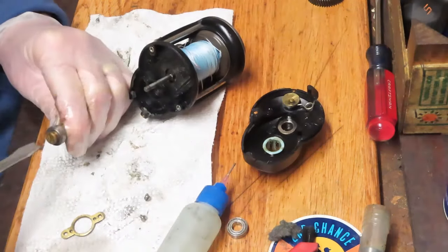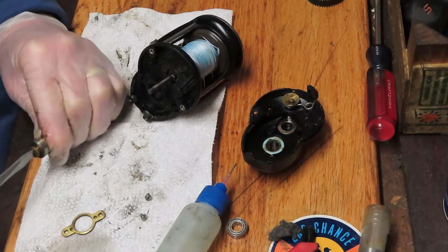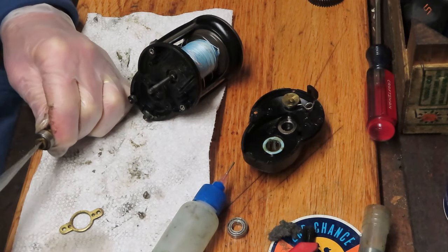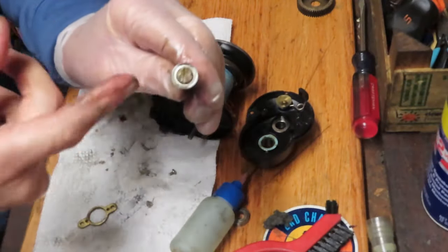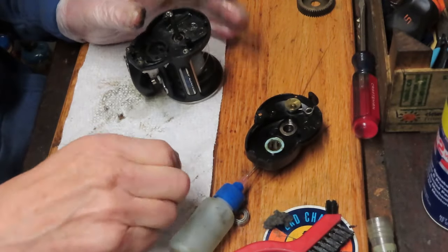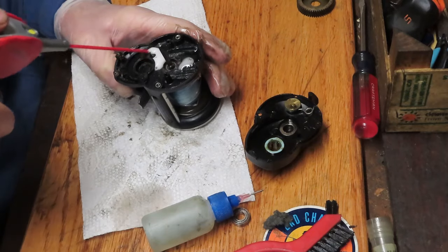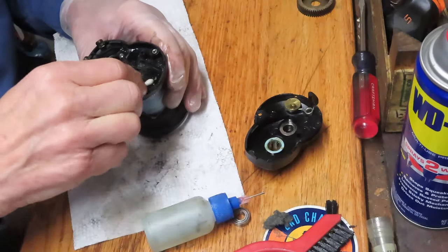We should do a little bit better here in terms of performance. So what was happening is the bearing was frozen — now you're trying to turn the whole bearing in that case, and that just doesn't work out. I'm going to have to put this back in the vise to make that last turn. Now we have a nice free-turning bearing, and that should fix this issue. I got lucky that I didn't lose those two little screws into my parts tray when I was dealing with all of that — that's when things go bump in the night.